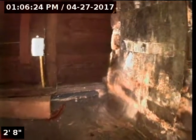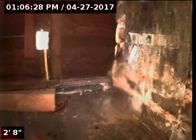I think we transition to a terracotta pipe here, and now in four-inch cast iron. That concludes the sewer scope. Recommend sewer line repair where the hole in the pipe is — the six-inch concrete pipe at the edge of the property line.